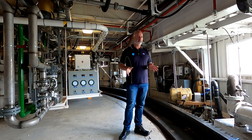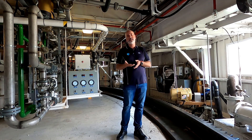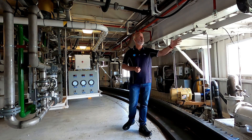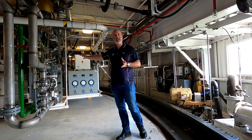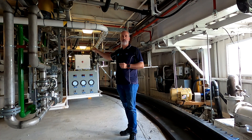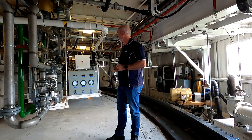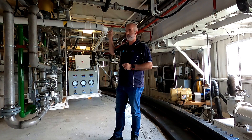The hydrostatic is an enclosed loop system, so the oil is continuously circulating. After the oil is injected under high pressure from the pads onto the runner to create the lift, it's recovered in the reservoir that runs around the antenna. Pre-charged pumps recover that oil and feed it through the heat exchanger here. The heat exchanger maintains a temperature of 38 degrees centigrade for the oil, which also keeps the viscosity constant. The heat exchanger receives chilled water from the adiabatic chilling system on the ground — a recent addition, just this last year. The oil then goes through a series of filters and is distributed back to the pads and the skid pumps, and the cycle begins again.